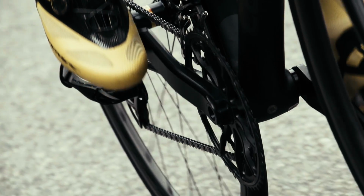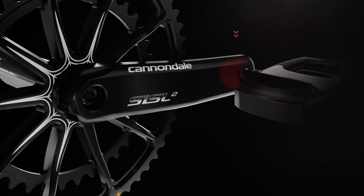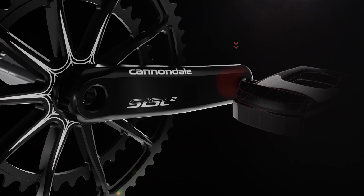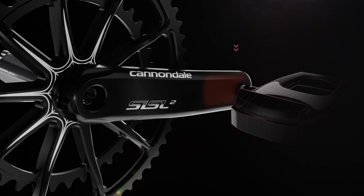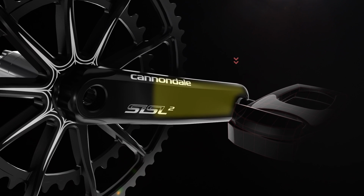One thing about the HollowGram is the outside shape is a very simple, smooth shape. A lot of the detail is on the inside, which structurally is very good because all the highest stress is on the outside of the cranks. So you want the outside shape to be simple and smooth so the stress can flow evenly around the crank.